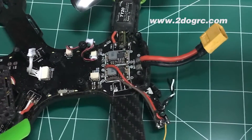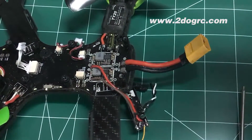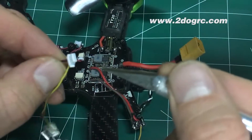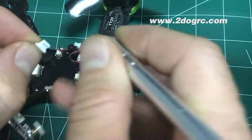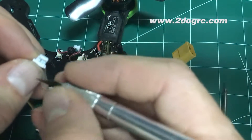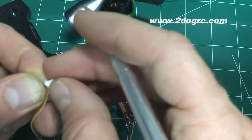What we're going to do is we want this to be 12 volt regulated instead of whatever battery voltage. This will help reduce spikes and clean up your video. You want to leave your video pin in there — the yellow pin — because that's not going to change. But you can take an X-Acto knife and just pop up these little plastic tabs in the connector. You just kind of put your knife underneath there and pull up. Pop it up, pull it out, and you're going to want the positive and ground wires out.